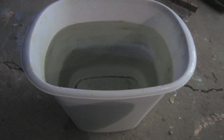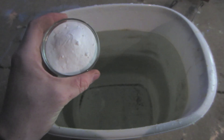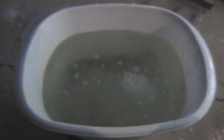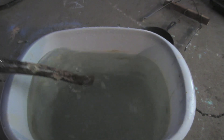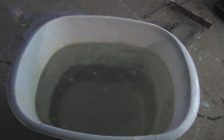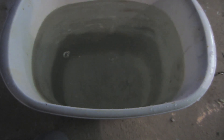Here is my six-gallon wastebasket with about five gallons of water in there. You want to add baking soda — about one tablespoon per gallon. That just makes the water conduct electricity better. I'm just using a stick to stir this up. This is not rocket science at all — it's so forgiving of a process. So now that's all ready to go. That's our solution for electrolysis.